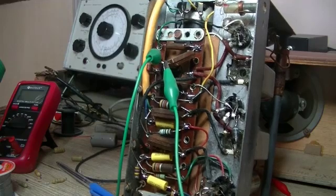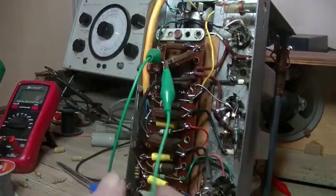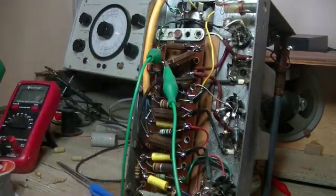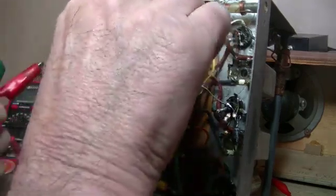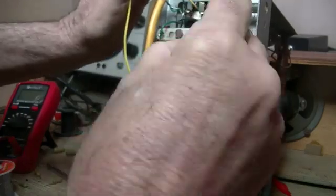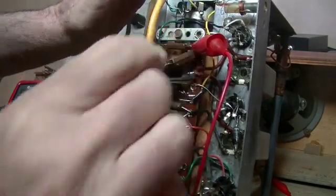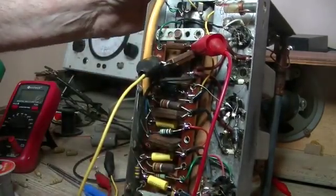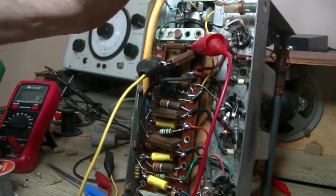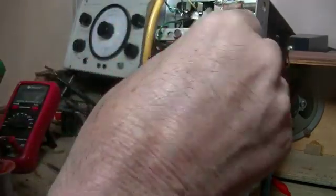My mind went to Micas. I took the first one out of circuit and replaced it - no change. But I found it on the second one. And this is why I've got this jumper here. Just to show you - a jumper in a new 100 picofarad. Let's kill the signal. And there - no more crackling. So that was the issue - crackling, and it just turned out to be a Mica. Nice and easy.